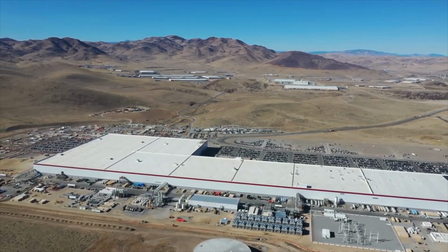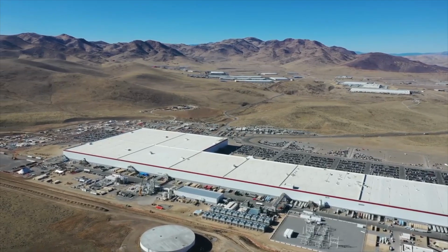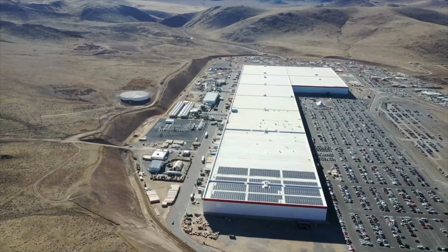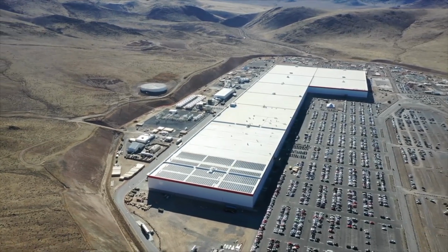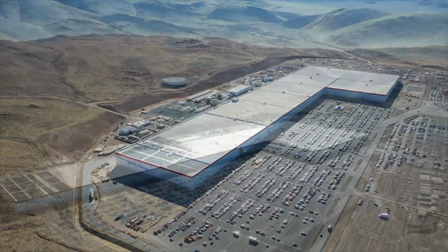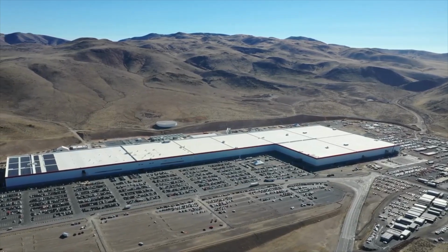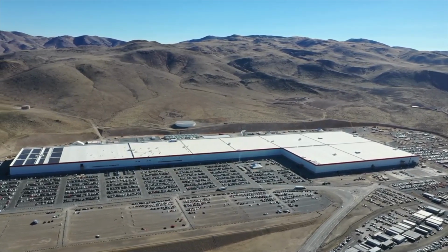The process also introduces a number of new variables in optimizing the battery chemistry itself, with the polymers and the percentage of that, the amount of exposed crystalline structure, the conductive additive, and so forth, the heat of the rollers it goes through, the speed it goes through, and so I expect to see some somewhat dramatic, or at least notable, improvements in the batteries themselves, while speeding the production of them. But a byproduct of all this is a very handy, almost complete diminution of space you need to produce a battery cell.